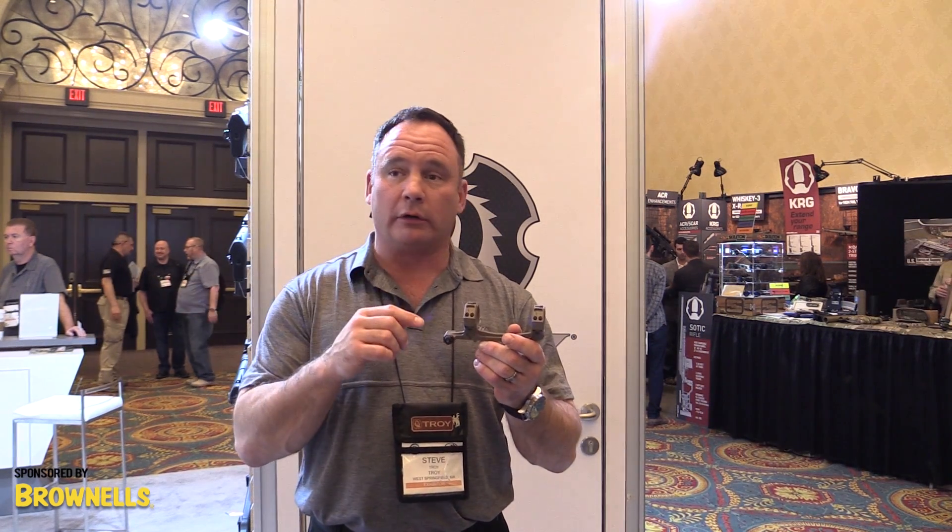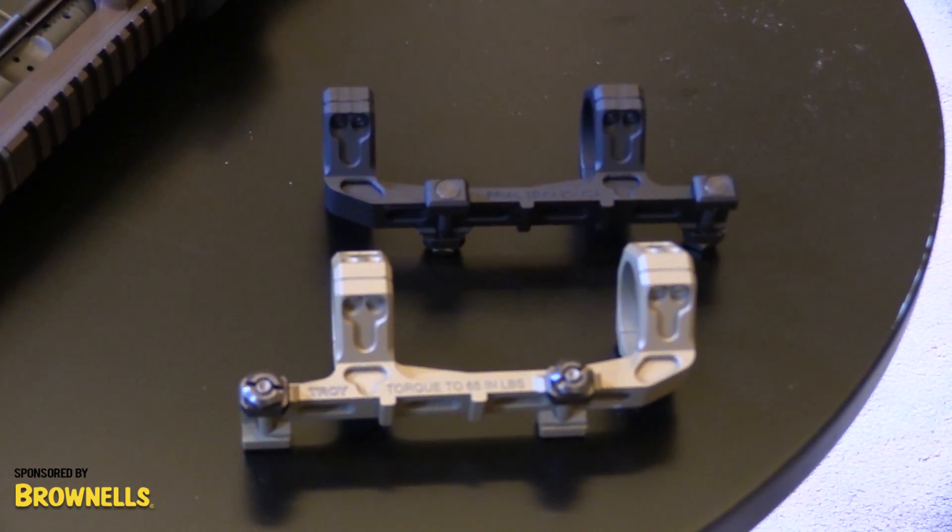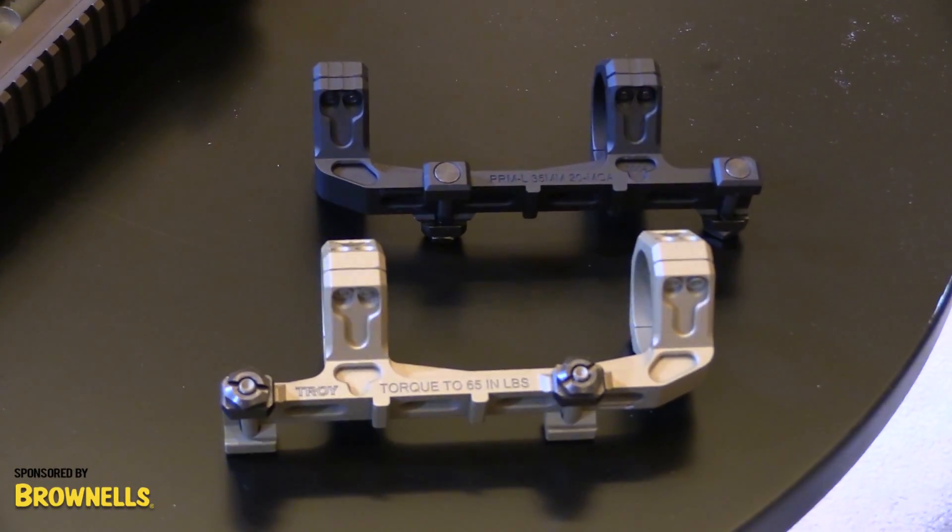Some features of this: it's made from a 12-pound block of 7075 aluminum. It's machined on our EDM in-house. We make our final cuts on the ring slice, the bore, and the rail on our EDM for absolute precision tolerance. We start with that 12-pound block and get it down to less than seven ounces.